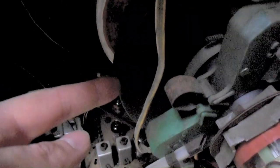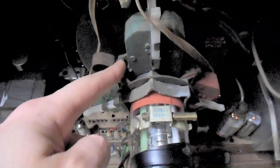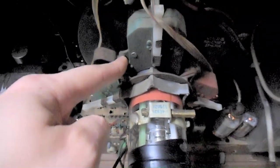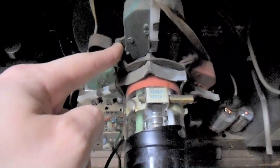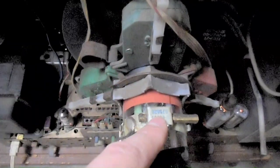This thing right here through right here is the deflection yoke. It moves the beams from the electron guns around the screen horizontally and vertically. This next thing here with the three colored pedals on it is the convergence yoke. It adjusts the relative deflection of the red, green, and blue to keep them close together throughout the screen. The convergence yoke I'll discuss in a little bit. Next are the purity rings here, and this is the blue lateral magnet. So, to achieve purity on one of these sets, you want to have a full red screen.